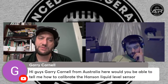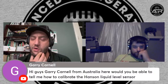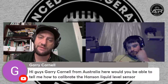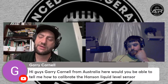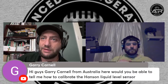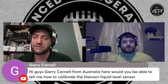Get it down to 0%. Adjust the Z span. Depending on where you're at, is it 1 to 6? Is it 1 to 6 and 0 to 5? Yeah. So depending on where you have it, get it so it's reading, I usually do 0.001, or just having it read right at 1 volt if you're doing 1 to 6.